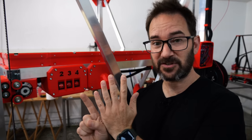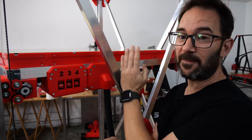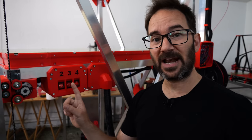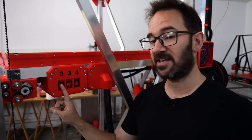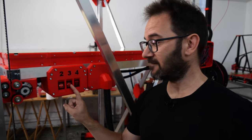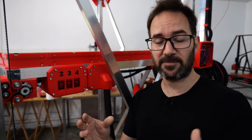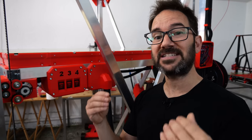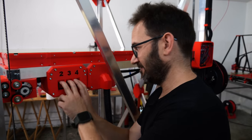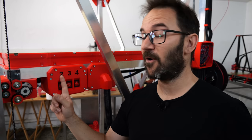The 6 heating elements of the bed are wired in 4 groups. The first group is 3 elements on one side of the machine. Those are always on. And the other 3 elements are wired through these switches in here. So you can have half of the bed heated up, 4/6, 5/6, or the entire bed. That way, if you want to print something that is long but is going to take only one side of the bed, you can use just half the power by switching these 3 off. Power saving. And this will be 4/3/2.